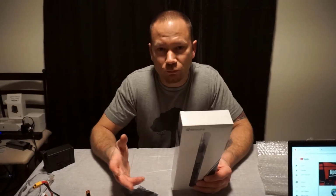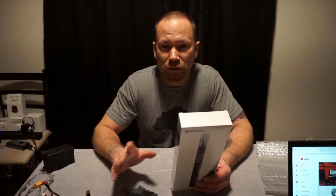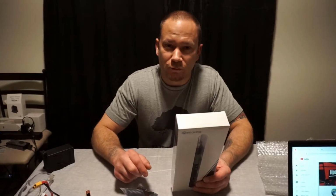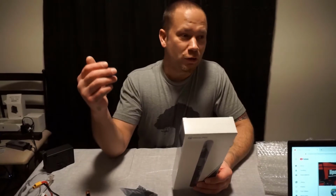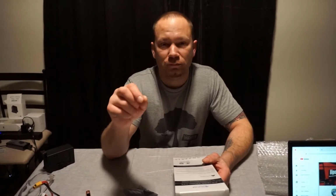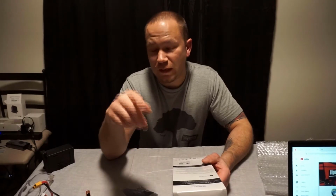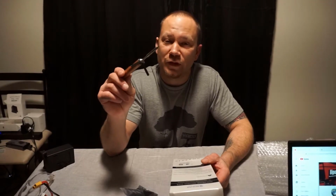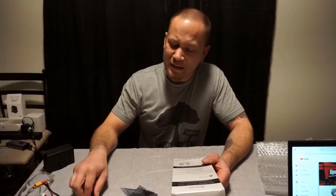a pre-soldered, all-in-one, 4-in-1 ESC, and you don't like the way that the wires are coming off of it. Prime example, your Hobby Wing X-Rotor 80 amp. They have the wires coming straight off the side. I like mine to go up. And if you have a little guy like this, regardless of how thick the tip is, if you're not able to get over 400 degrees, you're not going to get that melt.